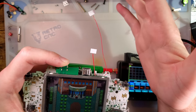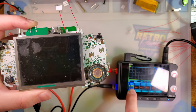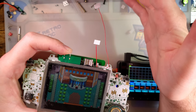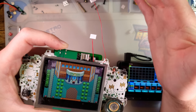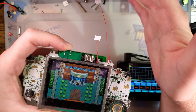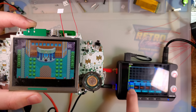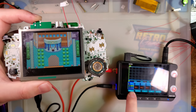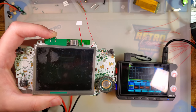But keep in mind, this does have adjustable brightness. So we have, at the bare minimum, 245 to 235 milliamps, and we have 1, 2, 3, 4, 5, 6, 7, 8, 9, 10 brightness levels. Yeah, okay. And on max brightness, this thing is pulling 366 to 376 milliamps, which is pretty high, but not nearly as high as some of the other kits I've looked at lately. Oop, I accidentally hit the touch sensor. Wonderful thing about touch sensors, but it is what it is.